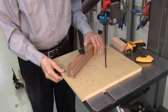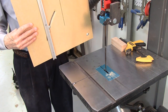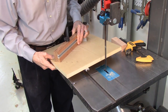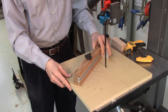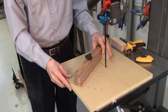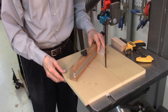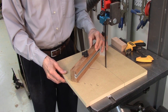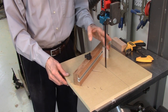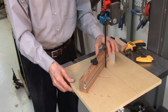This first version of the Celtic ring jig has a miter bar mounted on the base of the table, and this miter bar slides in the miter bar slot on the bandsaw table. It runs fairly smoothly, though there is a little friction from the surface on the bandsaw table. The only limitation is it does not have a stop to prevent the bandsaw blade from cutting completely through the wood and into the fence.